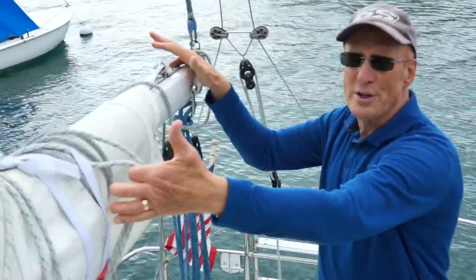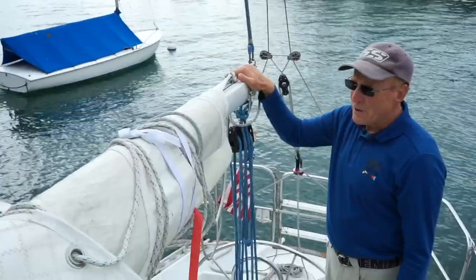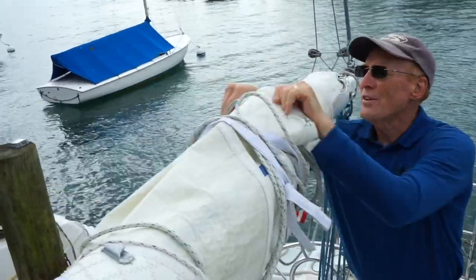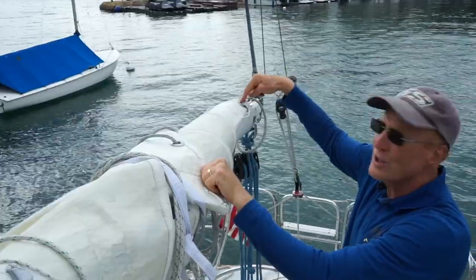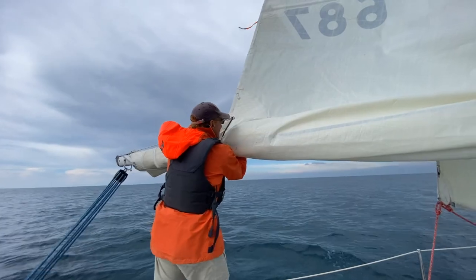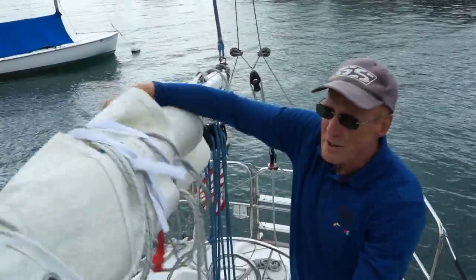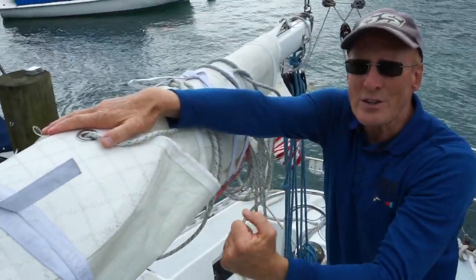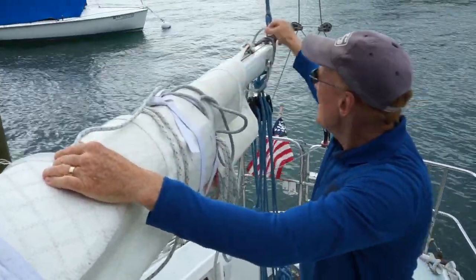These other lines that you'll see coiled here are our reef lines. The reef lines are made to loops on the side — this is our first reef, and this is a reef clew. Here is our sail clew. As we tension this down, it'll make a new, smaller reef than the original sail. The second reef is way up here and is made similarly — we tighten it down onto the sail and pull it back so we have a nice tight outhaul.